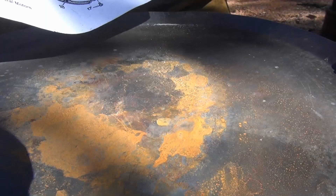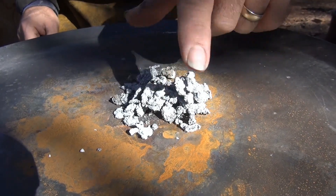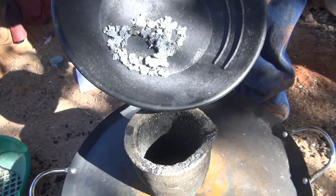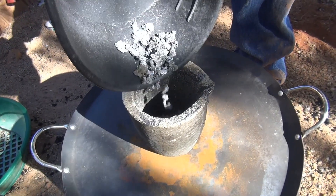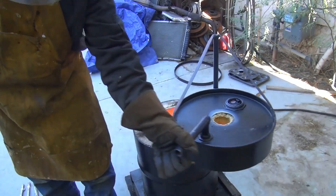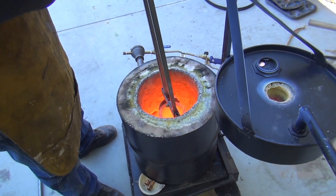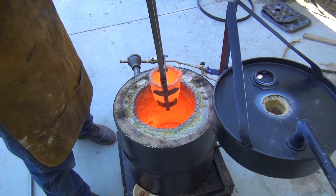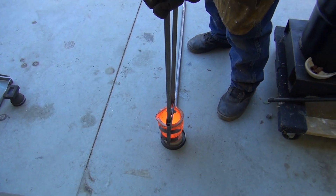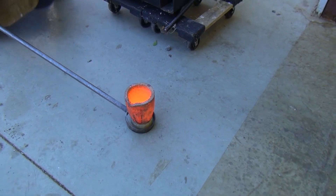Be careful — don't be breathing in those fumes. Then you're going to gently put that off to the side and collect it all up. What you have is a conglomerate of silver that has a little bit of lead still mixed in with it and a whole bunch of zinc. So we're going to have to burn it again — back in the crucible you go. More flux to get those impurities out. We raise it up to about 1,700 degrees — that's about the temperature that silver melts. When we're done, we should have a bunch of pure silver in the bottom.